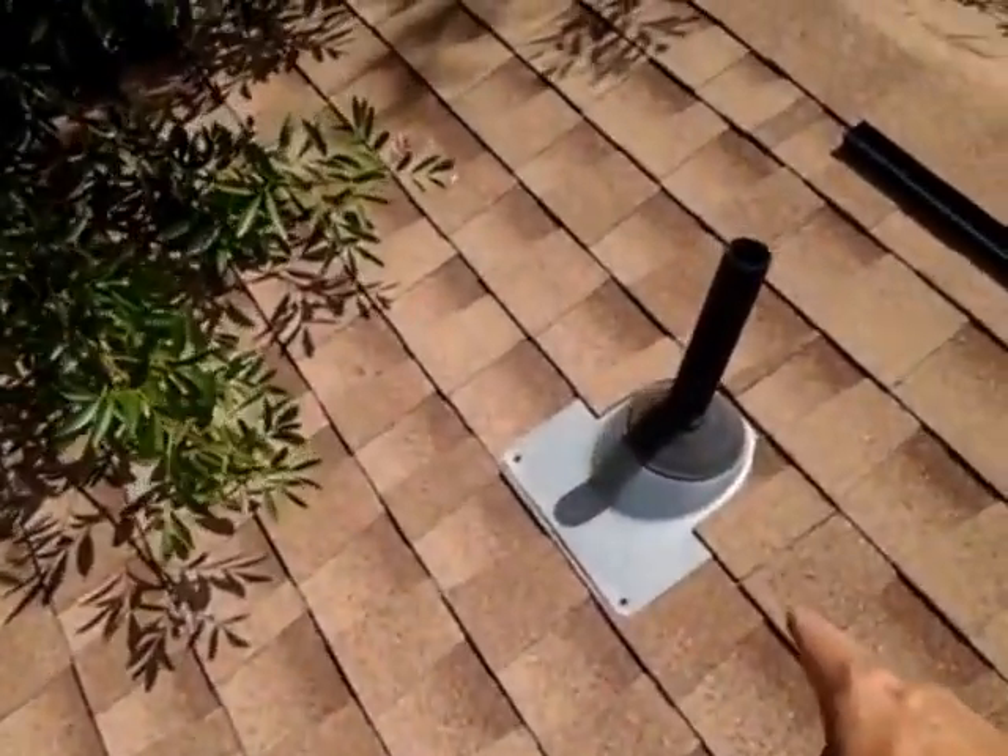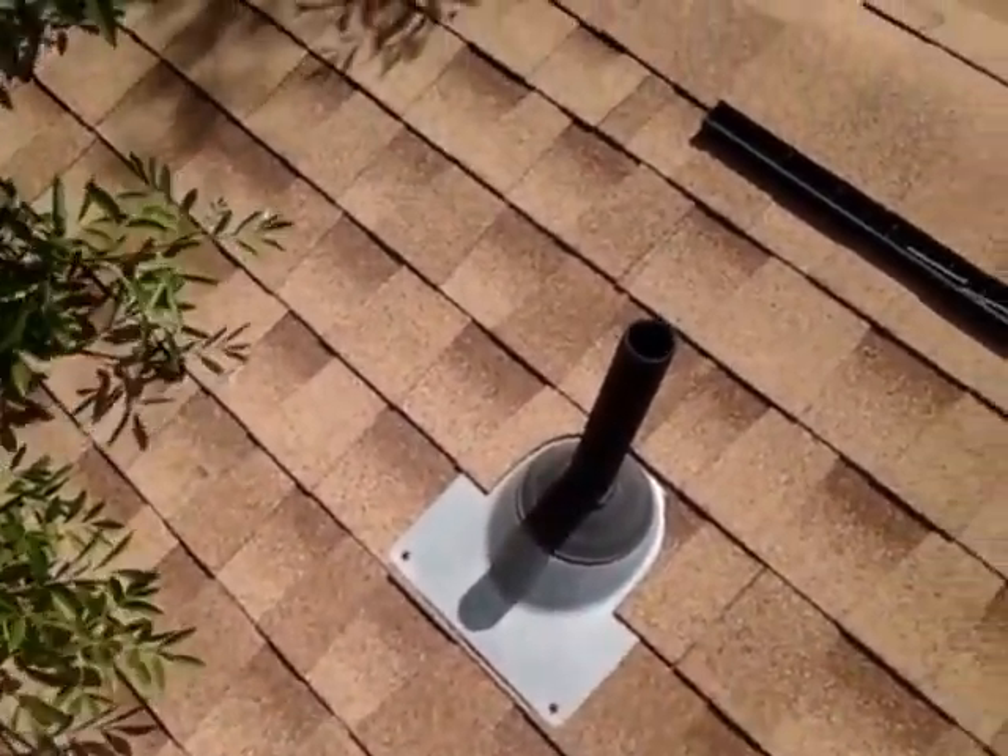Same as on these — the nails need to be covered up. You've got this area here where you've got this ash tree that is growing right over the deck. This does need to be trimmed back. This will be an ongoing maintenance issue where you need to keep it back, because what it's doing is wearing the shingle down. So you've got worn shingles in this area.